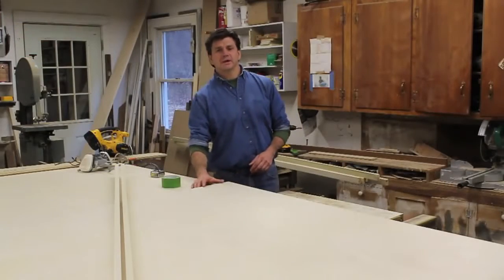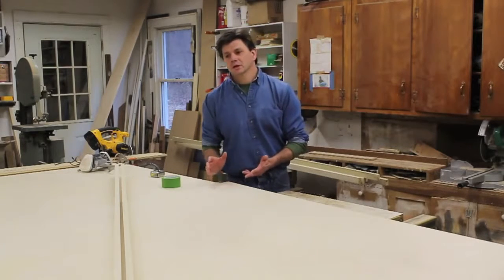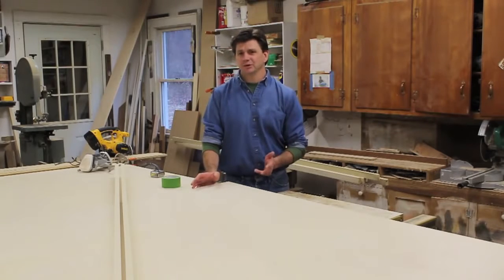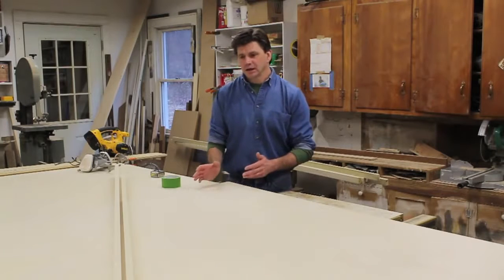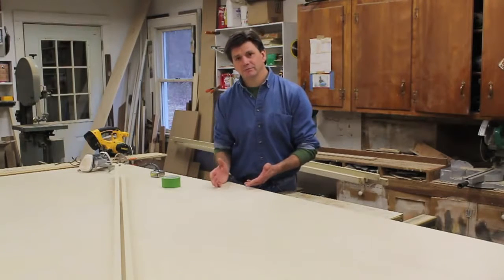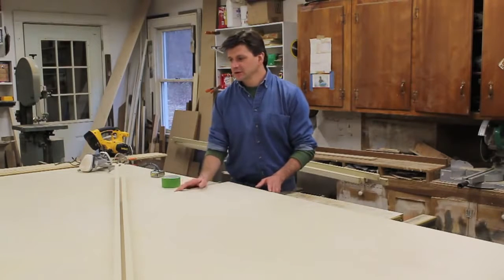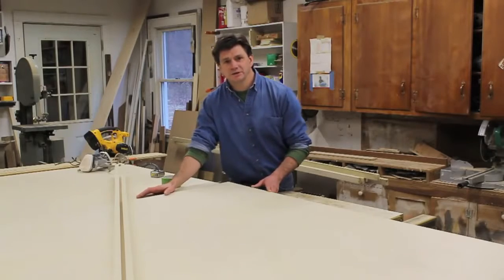Hi, I'm John Peters, and in this video I'm going to make a ping pong table. Now I've decided to use Baltic birch plywood, and the main reason for that is Baltic birch plywood is sold in sheets that measure 5 feet by 5 feet. And since a ping pong table measures 5 feet by 9 feet, this is going to make the job a lot easier. So the first thing I'm going to do is cut 6 inches off of each piece of plywood.